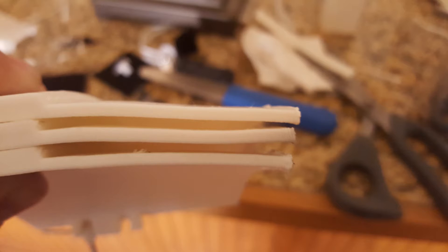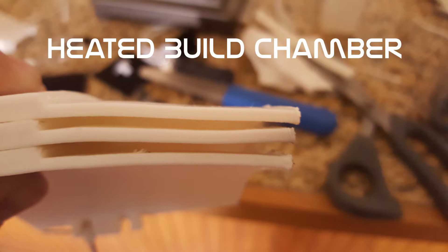The reason I made this was that I was having some problems with my ABS parts warping. In this picture you can see three of the test prints I did. The top one was with the heated bed — it's got the correct thickness and minor warping. The middle one was with the heated bed at 110 and it's severely warped and about 0.1mm too thick. The bottom one was done with ABS juice and no heated bed — it is 0.1mm too thin but has no warping.